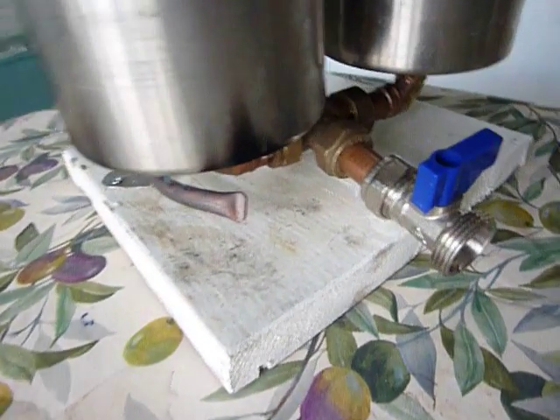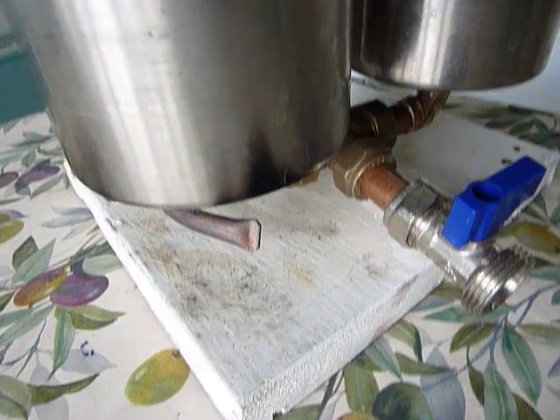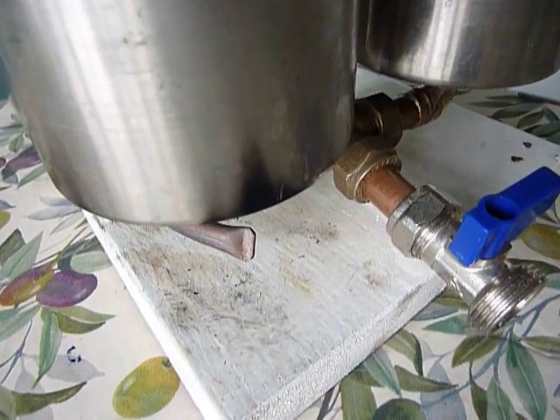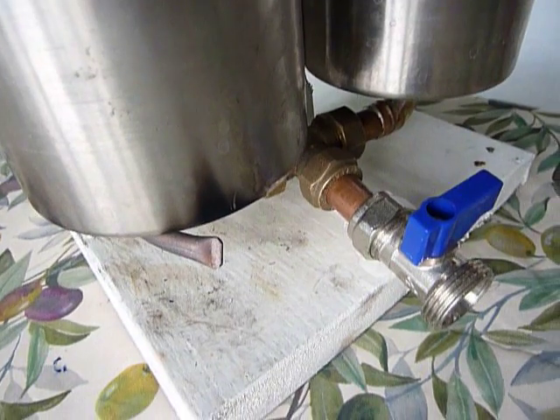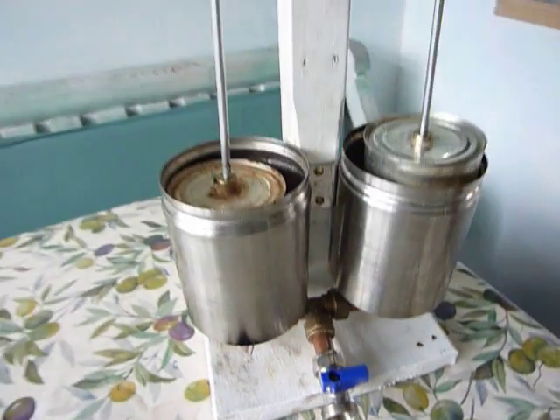Then there's the drain pipe. Water condensate does build up in the transfer pipe and can stop the engine. So the pipe tilts down a little to take the condensate away from the transfer pipe, to try and keep it open and let the engine run a little longer.